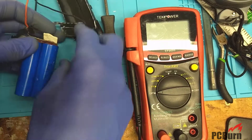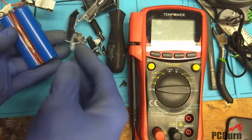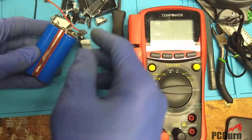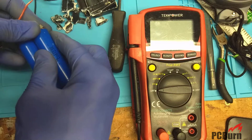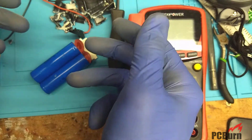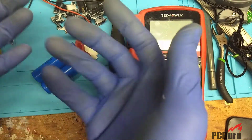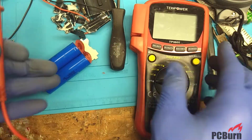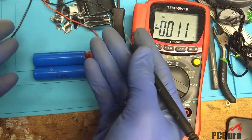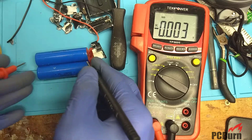I think I figured out the problem with the cells. A lot of people ask how to fix lithium-ion battery cells, and you can't — once they're chemically ruined because the anodes and cathodes are no longer properly rearranging themselves when charged, the battery is just dead. There's no fix for a dead lithium-ion cell. In very rare cases you can push a charge through if the cell wasn't damaged but just inert, though that usually destroys the chemistry anyway. The better bet is just to get a properly working replacement cell and dispose of the old one properly.